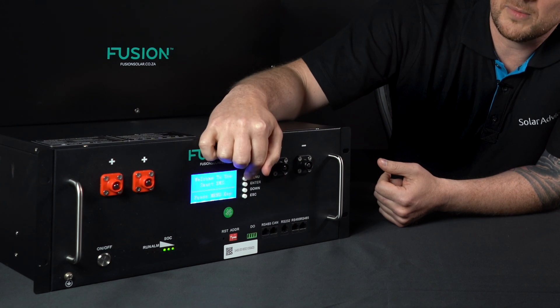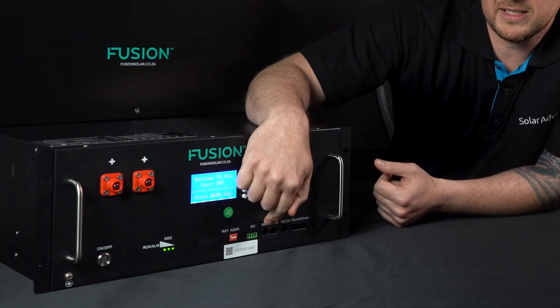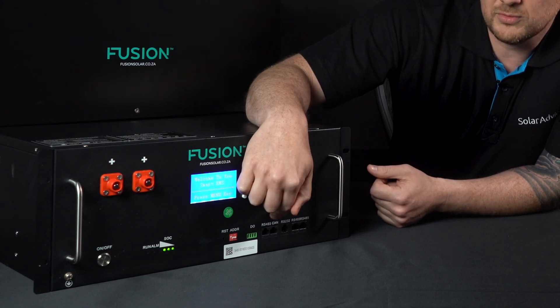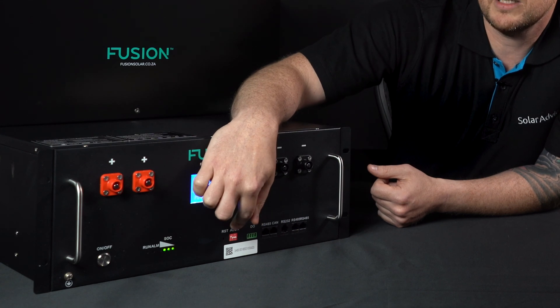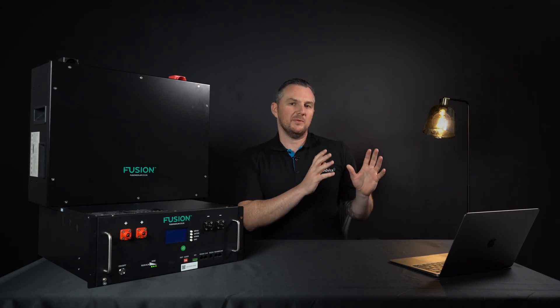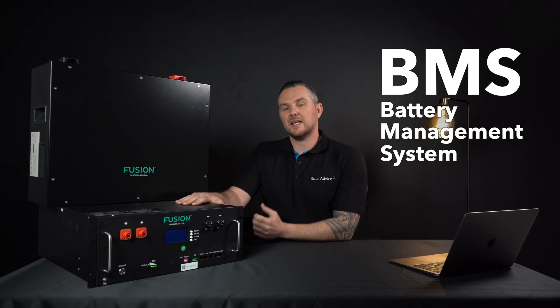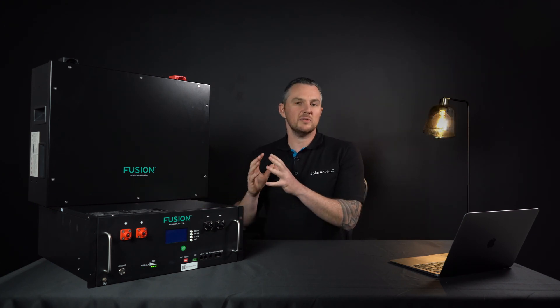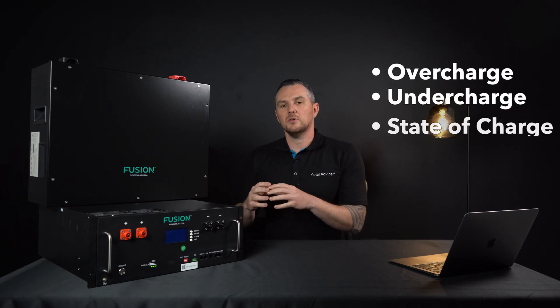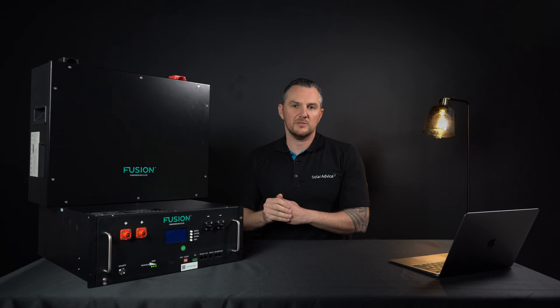You also sometimes have some options here for menu and so on, which pertains more to the actual display. Then you've got your CAN cable, which is your communications to your inverter, which we'll talk about later. You've also got these small settings for when you want to parallel your battery. Lithium-ion batteries like these should have a thing called a BMS — that stands for battery management system. This onboard computer monitors the battery, makes sure you don't overcharge it, and also monitors the state of charge so that when connected to your inverter, it knows how much is left in your battery.